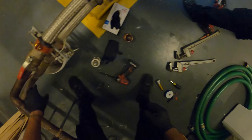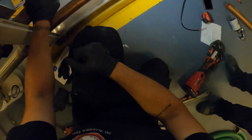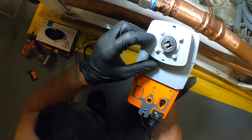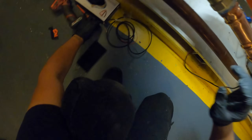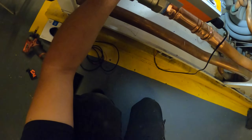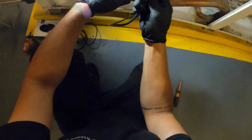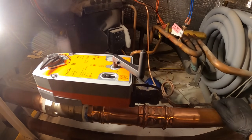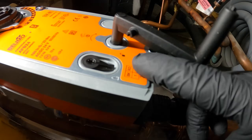Definitely want to open these slowly. They're both open — we definitely have water up to here. This valve is currently closed. Let's put the actuator on and see if this thing works. Here's our actuator — it's set on the body just like that. We've got these four little indents that go into these holes and this fits in here perfectly. Let's get that in place and tighten down this screw — it goes onto the shaft. And there we go. From here we only have two wires: it's 24 volts to power it and then it's a spring return. Everything is good to go. I left this little piece here — I think it's some sort of locking mechanism. Right now it shows this is unlocked.